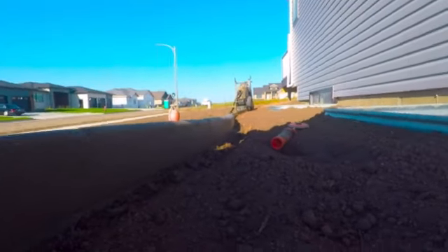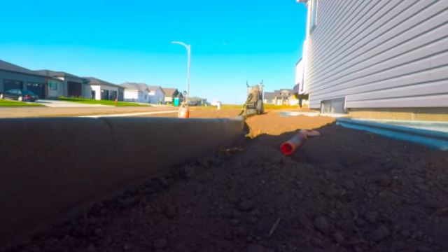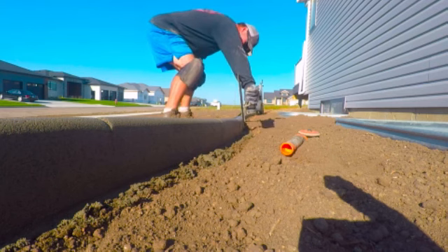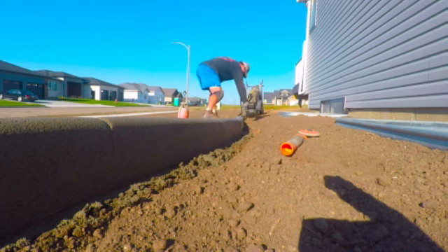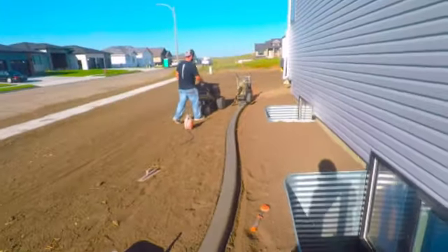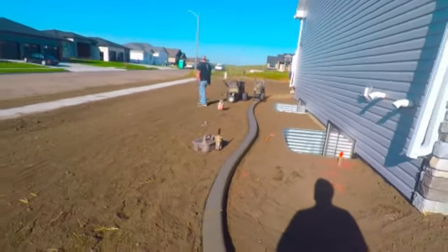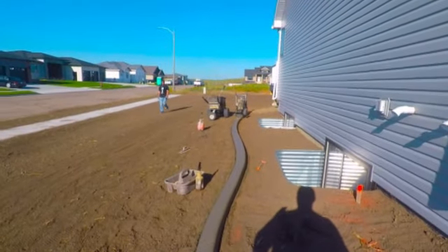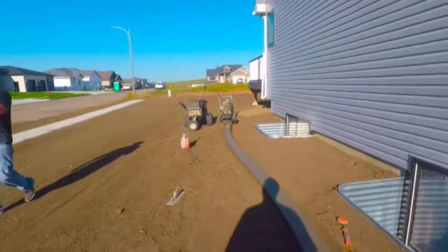Right here it looks like there's a little bump just on the back side. Visually, the back side of the curb is what catches your eye, so if you've got a little bump like that you can fix it by smoothing out the back side without having to move the curb at all. The curb's soft enough I can fix that just by manipulating the back. Now it's a little bit smoother. On that last mix, he had about two seconds less water in there — it wasn't dry, it was just perfect — and the machine jumps as it pumps it out, making it super easy to trowel.